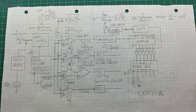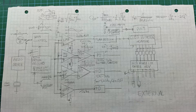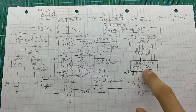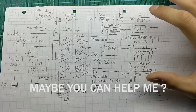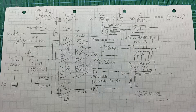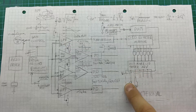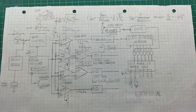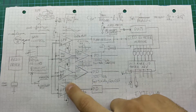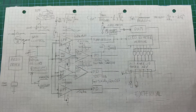The AND gate outputs all go to a high-power LED driver, which I think will be an array of MOSFETs — that's why I'm using PWM. This is the one thing I don't really know how I'll make yet. I've seen that you can make PWM with 555 timers, so I'll try that. These will change the intensity of the high-power LEDs, and there will be connections that can be hooked to LED strips or anything powered by 12 volts. The filters I'm going to use will also be different — I'll use simple bandpass filters made from a low-pass and a high-pass filter, which is just a combination of a resistor and capacitor.